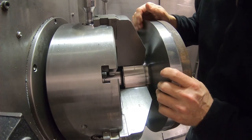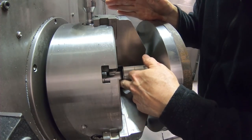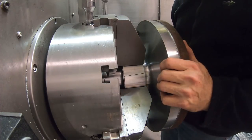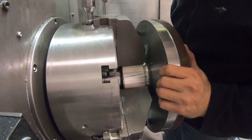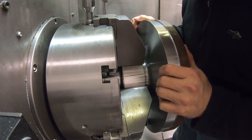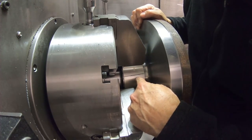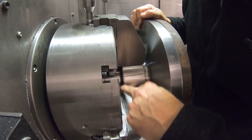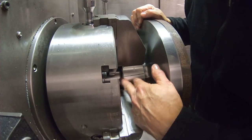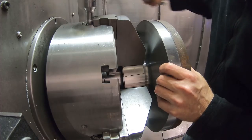I had to lift it that way because I want to try to get it up in the spindle without scratching up these surfaces. I found that that clamp would kind of let me do that - it kind of balanced on the clamp. But now I've got to snug the jaws up a little bit. I've got this aluminum sleeve on here because I didn't want to mar up that surface, although it's not a close tolerance - I still didn't want to mark it up because these chuck jaws aren't in perfect shape.